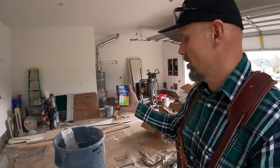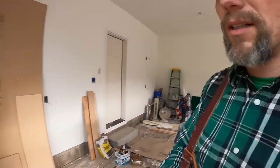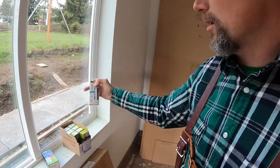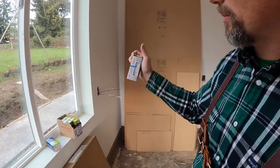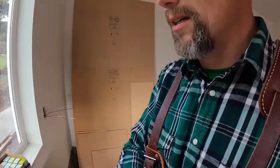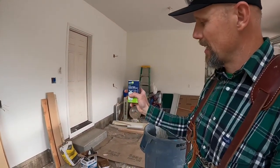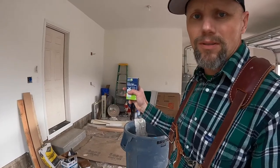So everything's gonna be a 20 amp breaker. So make sure you have a 20 amp GFCI, and all of my outlets are gonna be also 20 amp. You can't change or reduce that to 15. It's made differently, use 20. It also has the little line on it that indicates that it's a 20 amp service.